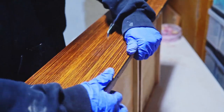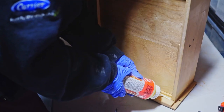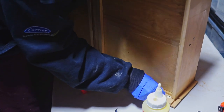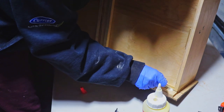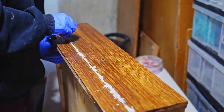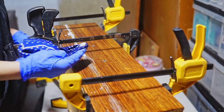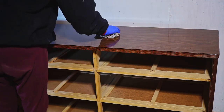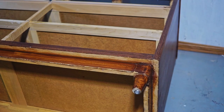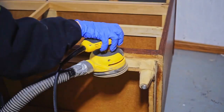I started with the two top drawers. I removed the hardware first, then squeezed wood glue inside the cracks. I wasn't sure it would work because the crack was in a weird place, but I decided to try. I squeezed glue into the cracks on both sides, clamped them, and let them dry. While the drawers dried, I gave the dresser a good clean. I wanted to remove the base, but found it was glued in solid, so I sanded it without disassembling.